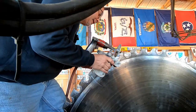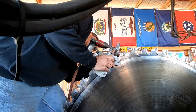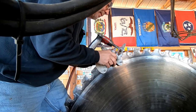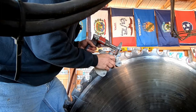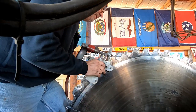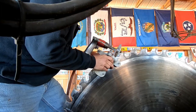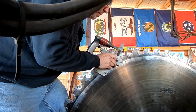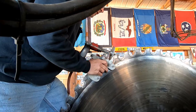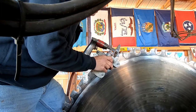All right, we're going to sharpen up the blade here. So basically we're just going to go tooth to tooth. It's not going to take all that long if you get her set up. Then there's a dressing stick — basically it cleans the diamond. And that takes all the carbide out of the diamond. It was getting due for sharpening last time we saw it with that spruce. So we've got a lot more spruce to cut here. We'll just work our way around the blade.